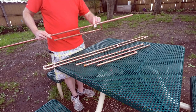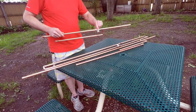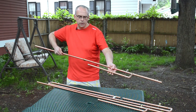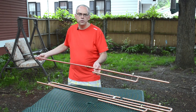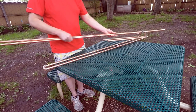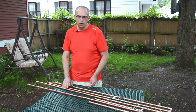All our antennas come standard with the SO239 connector right in the middle, but are also available as an option to get the end connector. What I have in my hands right now is the 2-meter breakaway antenna. A big difference with this antenna is the screw connector in the middle, so it makes it easy to ship, to transport, to break it down for storage, and take it out into the field. Once it's screwed together, it's the exact same length as our standard J-Pole antenna, so it has the exact same performance and characteristics. The breakaway model is also available in the VHF land mobile frequencies.